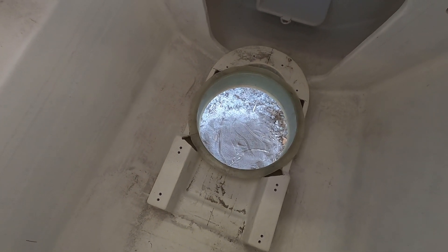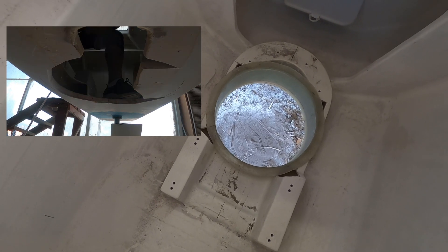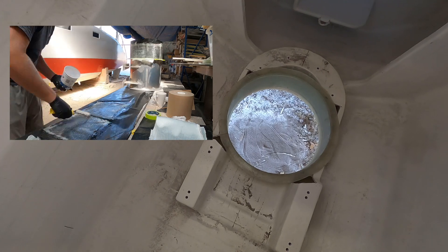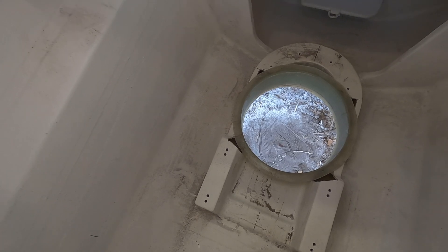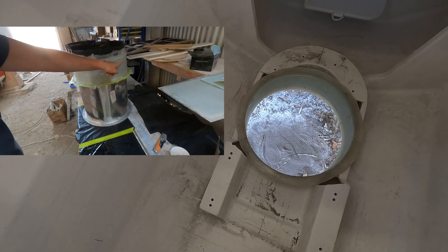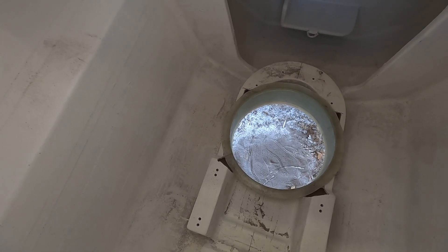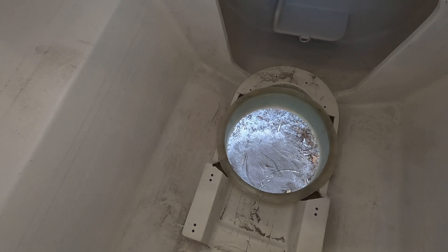So after drilling or cutting a great big hole in the boat, step two is returning the strength to the hull that I removed. I glassed up these cylinders and they're over five millimeters of glass where half of it is unidirectional glass. They're very stiff and very thick and they're replacing the material that I cut out and adding more stiffness to this section of the boat than was there before, I believe. Right now it's clearly weaker than before, but first things first — we make things fit, then I'll glass them in place, and once it's all glassed in it should be at least as strong as before and hopefully a little bit stronger.